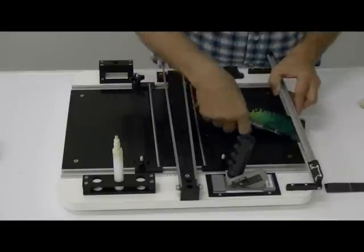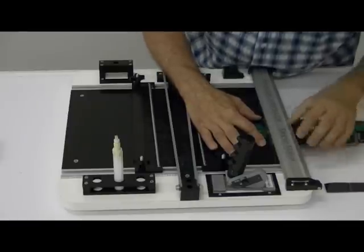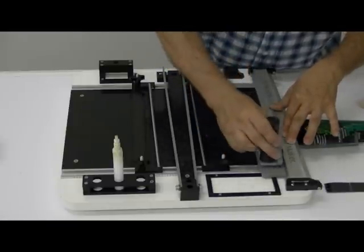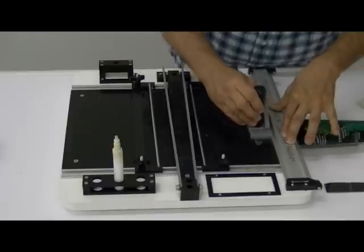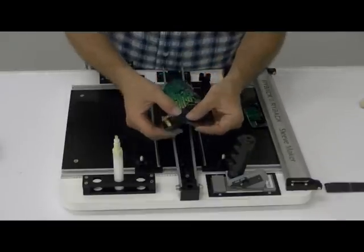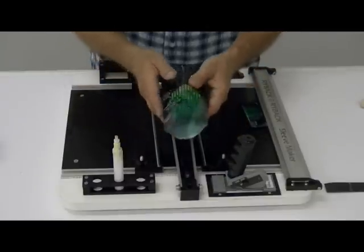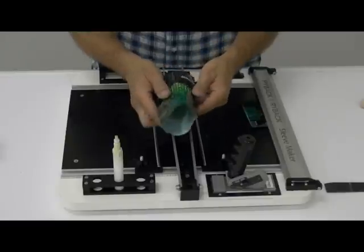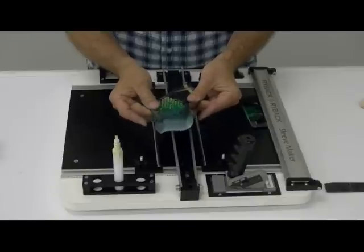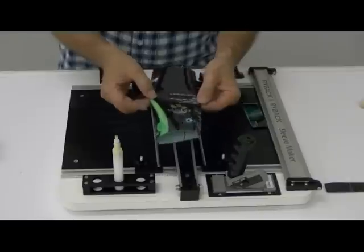I'll repeat the same process on the other side, lining up my edge so it lines up exactly to the line in the bed of the machine. Again, pushing down slightly on the clamp, pushing down on the cutter, and sliding it forward. Now I have a solvent seamed hand sample with a two millimeter clear area at the top and a two millimeter clear area at the bottom. Since this is in a tube form, I can rotate this to any position I want to determine my seam location and fold location, and once I do, I could just gently put a fold in it. I have my solvent seamed hand sample.